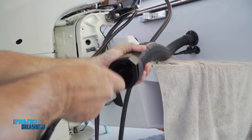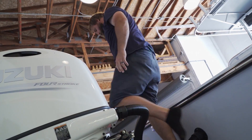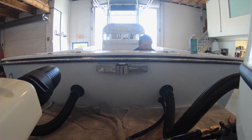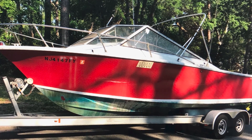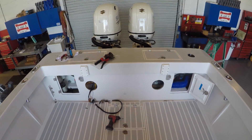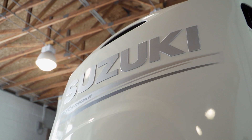When we engineer out how a rigging tube is going to lay on the bracket or coming out of the boat, you are drastically reducing the chances of having problems. If you break a wiring harness because it wasn't rigged properly, you're dead in the water — and hopefully your VHF radio will reach Sea Tow. We've always prided ourselves in doing the best possible job for the customer. I was excited to see how the boat was going to run, originally being a single I/O boat with a cuddy cabin and the total transformation to a center console twin engine outboard boat. That boat was way ahead of its time and still is one of the best riding 23-foot boats on the market — and now with the Armstrong bracket, the wide body flotation bracket, and a pair of efficient 150 Suzukis on it, it really turned out to be a neat project.